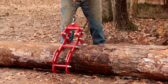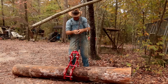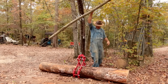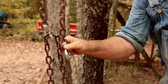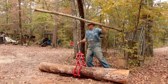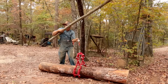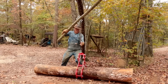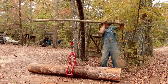I've got the hoist hanging up in the tree, and another short chain connects the tongs to one of the side hooks on the leverage hoist. Now, by tilting the opposite side of the pole down, leverage is obtained because of the offset of the eye bolts. The loose chain can then be hooked below the first one. Then the opposite side of the pole is pulled down, tightening the second chain and loosening the first one.